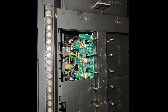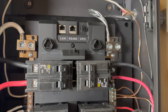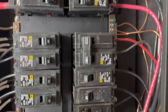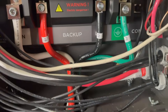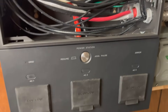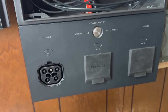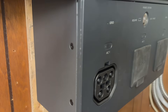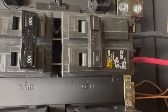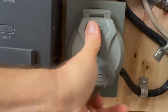If the grid power is unavailable or you don't want it on, you have two other places for power input. Down here is where the battery connects in — I have the Delta Pro Ultra, but you can also use an adapter with two Delta Pros. The whole bottom box with the three connectors is removable, so if you wanted your battery somewhere else like the garage, you can wire it in from a different location. The other input source is from a generator; I had the electrician install a 50-amp generator inlet box and I'll do a test shortly.